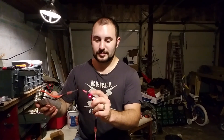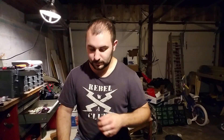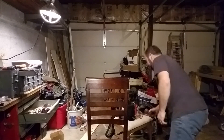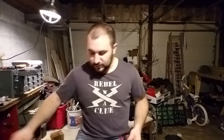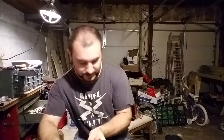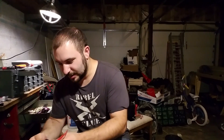If I had a whole bunch of 18650 bays hooked up, I would definitely need one of these per bay because that's a lot of charging for one little circuit board. But it works flawlessly — no issues whatsoever. Now that it's all up to operating temperature: 1.12 amps from my supply battery, and the actual current from the buck boost converter to the charging board is 0.444 amps.